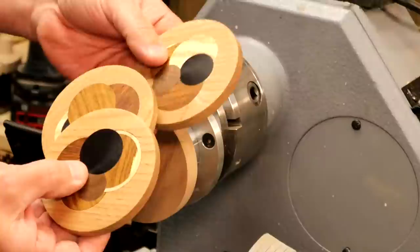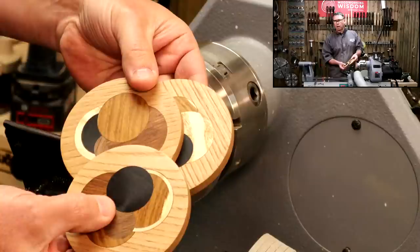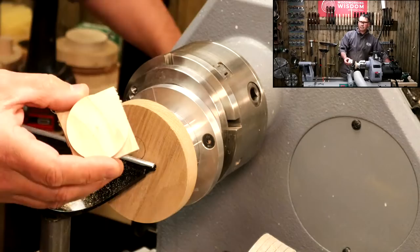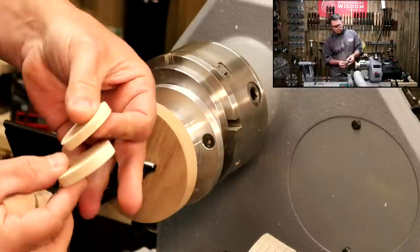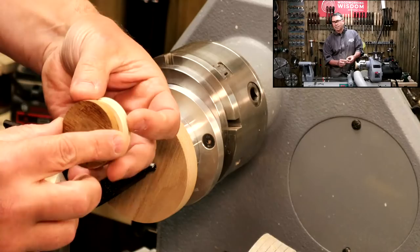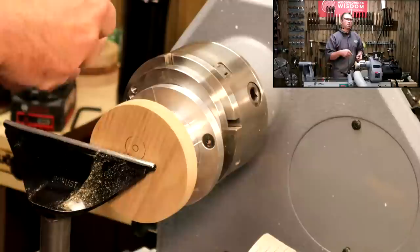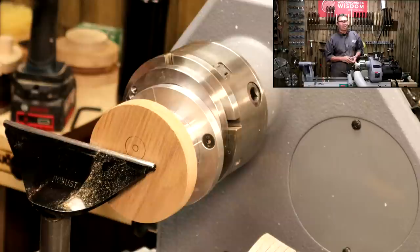It's a chestnut main coaster and we're infilling with lots of solid colors from some scraps we found in the workshop. Before everything went wrong a minute ago we were just making a few little wooden discs from a square section using side grain, creating a few of these in various timbers. Now we're going to start making the recess to hold each one, glue them in, then plane off that top surface on the lathe so we've got a nice coaster. I'm probably going to do about three or four inserts in this one.